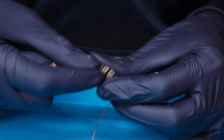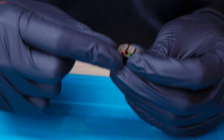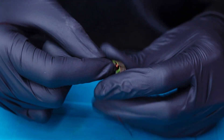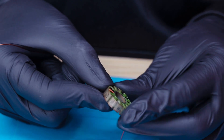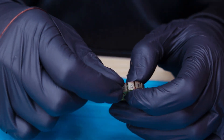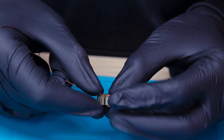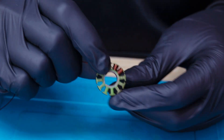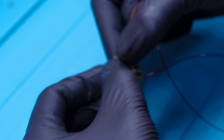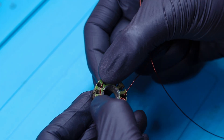Ten turns completed on tooth number one and now we are moving to tooth number two, which is in the anti-clockwise direction. After every two or three turns you can push the older windings to the inner side so there will be enough space for new windings — otherwise this can lead to overlapping and the winding will look really ugly. After the first routing is complete, make sure it is well placed. Now we are starting with tooth number seven, which is again in anti-clockwise direction.